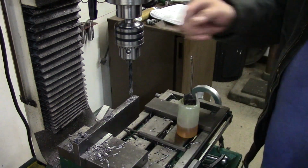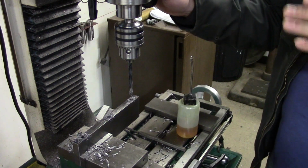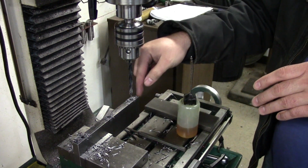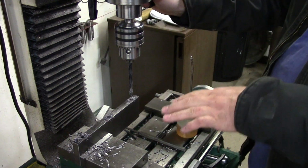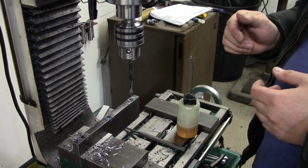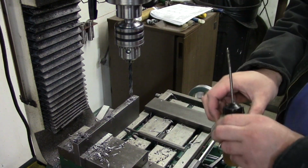Okay, now, I could have drilled all the way through and then just tapped all of these, flipped it over, and then tapped them again. Now, the risk of that is the deeper you drill, the more the bit will wander. This is not a gun drill, so it's not going straight. I mean, it starts straight and it slowly probably walks a little bit one direction or the other. Which, if you have large enough clearance holes in the mating part, you can do that. But I'm kind of anal and I like to be precise, so I'm drilling about halfway. I'm going to tap them and flip it over and drill and tap the other side. So once I finish tapping this side, we'll conclude the video, because the other side is exactly the same. Just wanted to quickly explain that.